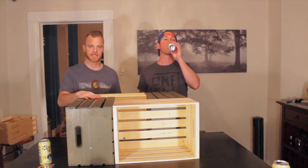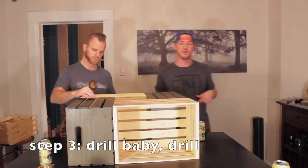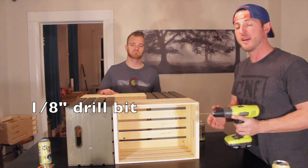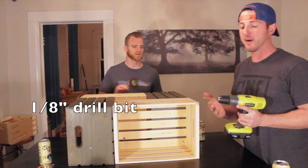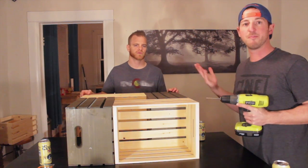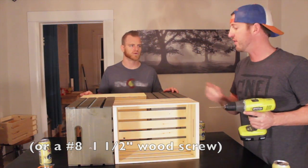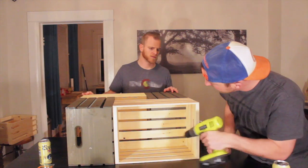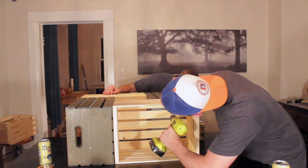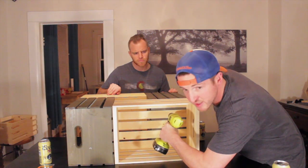Now that we've got it all aligned, next step is assembly. We're going to drill through the wood to create the connection from piece to piece. I'm going to use a power screwdriver with a one-eighth inch drill bit. If you don't have a power screwdriver, just go to your local hardware store and pick up a number eight, one and a half inch wood screw and use a regular screwdriver. We're going to drill a hole through the second from the bottom slat and the second from the top slat on both pieces — this will create the connection for the machine screws.